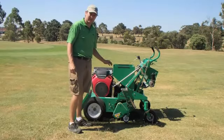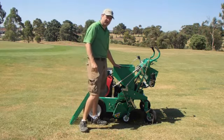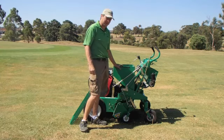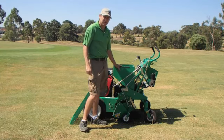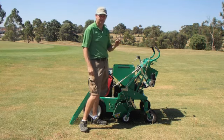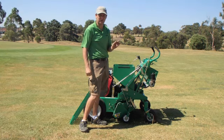When we go to do our test cut for our blade depth, make sure the hopper is empty. Otherwise you'll end up putting sand everywhere and it'll make it a lot more difficult to calibrate depth to the sand. Once you have got everything calibrated, then you can put the sand in and start operation to adjust your speed to your sand flow rate.